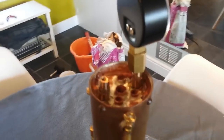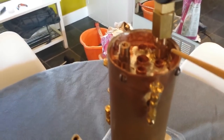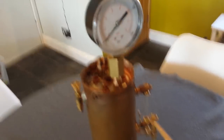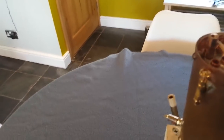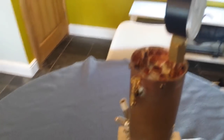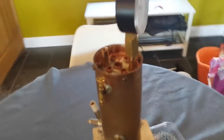On top of the boiler we have these two bushes. Fitted to these bushes at the moment is this pressure gauge, which is simply for the purposes of this hydraulic test, and the other one is open so that when I fill the boiler with water I'll fill it right to the top of this bush, then screw in this little blanking plug sealed by PTFE tape to seal the system before we increase the pressure.